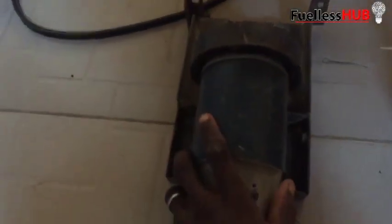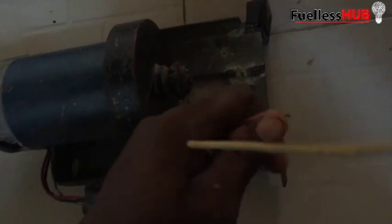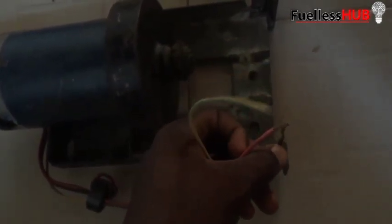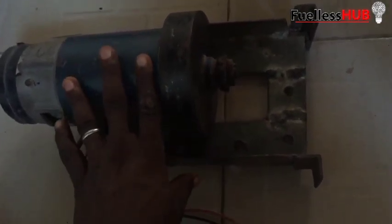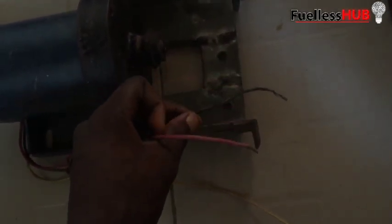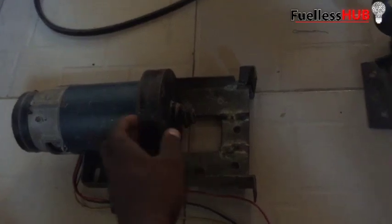This kind of motor is called the treadmill motor. You have to feed it 180 volts for it to begin spinning at the rate of 4,000 RPM. The horsepower of this particular motor is 1.5 horsepower. Any device you are hooking up to this motor — you must be ready to use multiple batteries to power it, because it uses a DC voltage of about 180 volts.